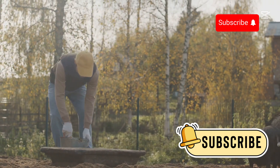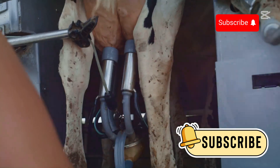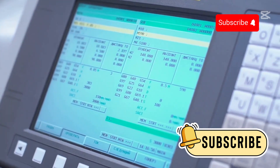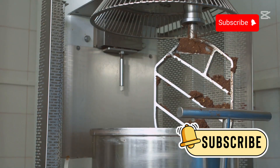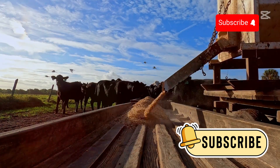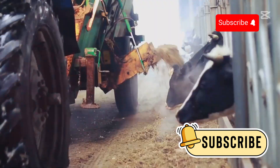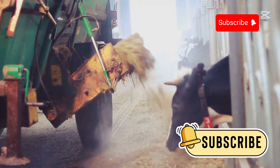Instead of having to mix feed by hand, farmers today often use livestock feed mixers. The operator uses the suction unit at the front of the machine to draw the ingredients into the container. During this process, the electronic weighing system automatically measures the weight of each ingredient. Once the ingredients are in the container, the mixing shafts and mixing grid thoroughly mix all of the ingredients, creating a mixture with a uniform texture. Water can be added to make the mixing process easier. Modern mixers can have a capacity of up to 21 cubic meters of feed in just one mix. After mixing is complete, the operator adjusts the discharge chute to deliver the mixed ration to the livestock feeding trough.